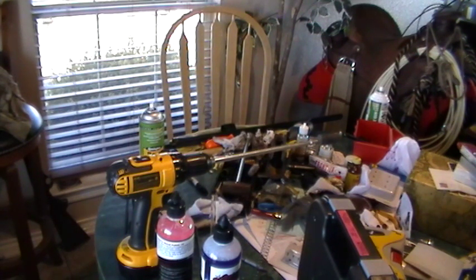Again, this is a Remington 1100 — it doesn't matter what the brand is or what the gun is. If you buy a high-end two-thousand-dollar shotgun, the barrel is already going to be polished. But when you get into guns that aren't so high-end, sometimes they just don't take the time to polish and smooth them out. A little steel wool on a brush, hook that up to your drill, polish it up — it can't hurt and it will increase your feeding and ejection. That's my polishing-the-barrel tip.